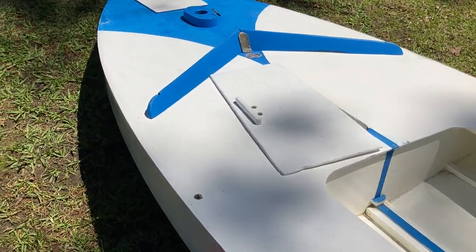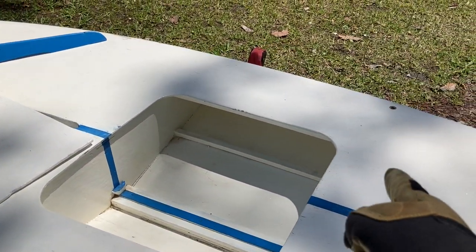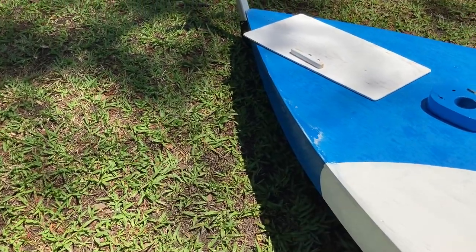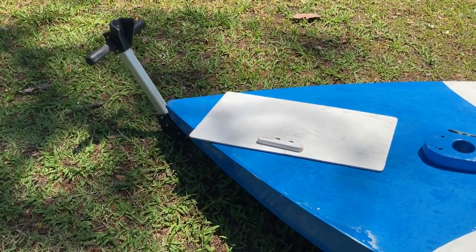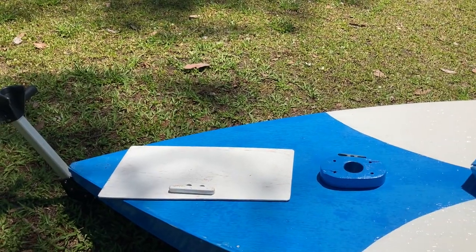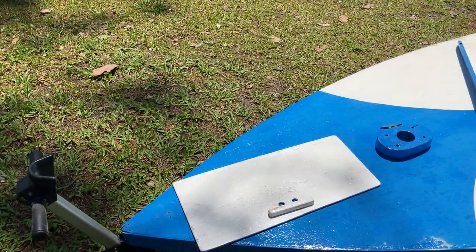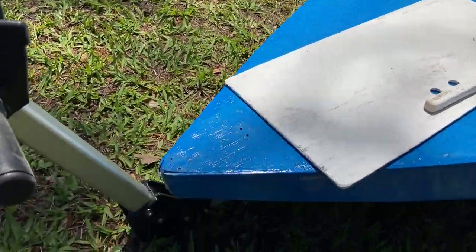So we did an air leak test, put some low volume, low pressure air into the drain plugs, and found a few small leaks along the seam under the rub strip, probably from fastener holes that went in. We could have probably prevented that. We're talking about maybe 5 or 6 areas out of the whole 30 feet of deck seam. I could have prevented that, maybe put a little epoxy or varnish on the screw into the pilot hole before we installed it. A few leaks up at the bow.